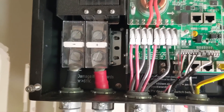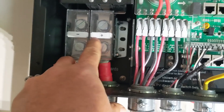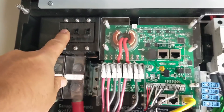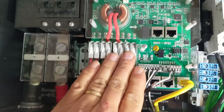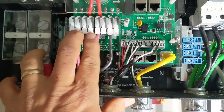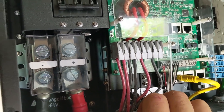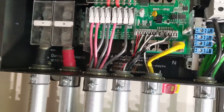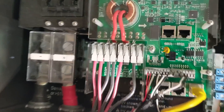In this user-defined area, from left to right we have our battery negative and positive - you don't want to mess those up. Then your solar, your two MPPT trackers - you have four connections: positive, positive, negative, negative, positive, positive, negative, negative. We have a string of nine, string of eight, and a string of nine on this inverter. On the other inverter, same deal - eight, nine, eight. We have 51 panels, 17.6 kW coming in on six separate strings.